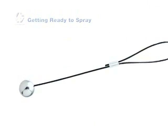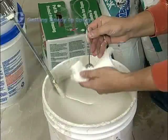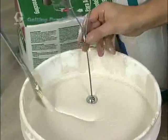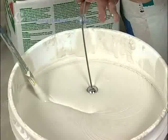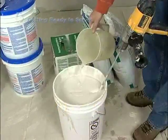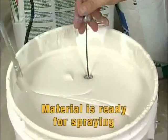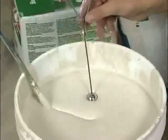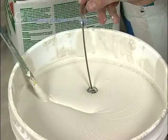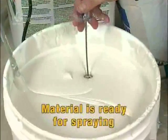The material thickness gauge provided with your sprayer will help you determine if your texture material is the proper consistency for spraying. Once the texture is mixed, gently rest the material thickness gauge on the surface of the mixture. When the material is thin enough to spray, the ball will sink completely into the mixture. If the ball does not sink completely within 10 seconds, add more water and try the test again. Be sure the gauge is completely dry every time it is used for an accurate test. Check your material thickness periodically, as the material may thicken as it sits and slow down production or impact your finish consistency. Agitate and thin the material as needed to maintain a consistent texture finish throughout your entire project.